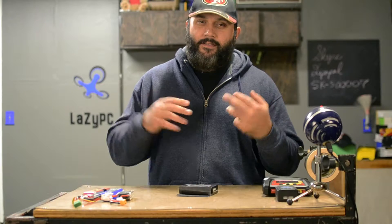Not to get into very detailed talk about LiPo batteries right now because we'll do that another time. Balancing multi-cell batteries is very important because it helps them discharge evenly. If you've ever had a cell go bad in a battery, it's typically because that cell was discharged beyond what is safe to recharge it at, and it couldn't recover.